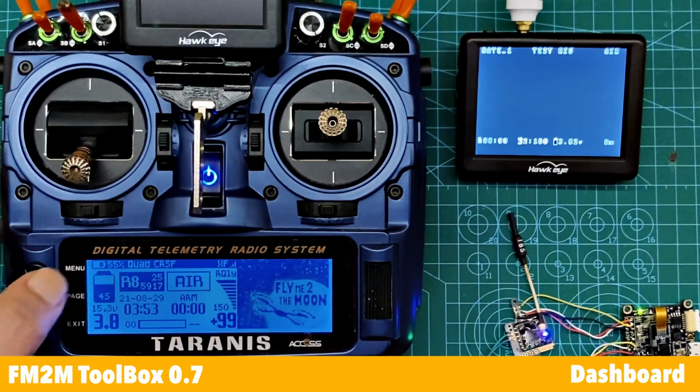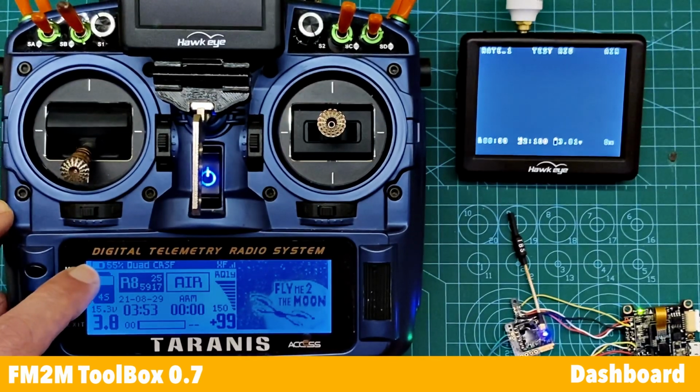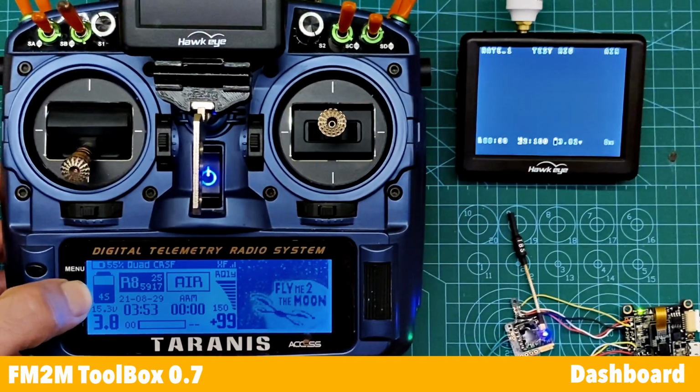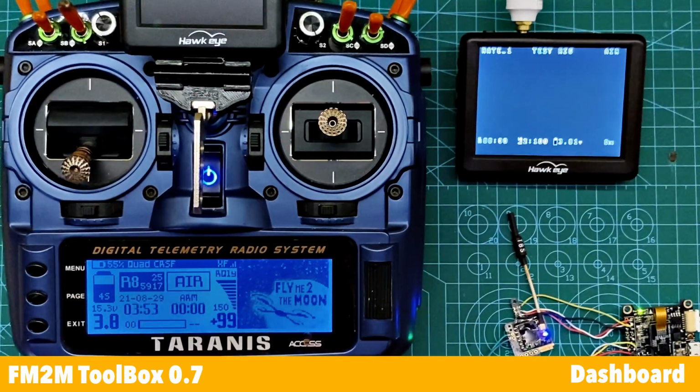All right, so here is, as I said previously, the transmitter battery status, and in fact this is taken from the OpenTX or EdgeTX settings. Whatever you set, like alarms and voltage scope, it's read from there and presented as an indicator. Here is a visual indicator of your quad pack, 4S as I said previously, total voltage and average cell voltage, right? Of course, your selected model name here.